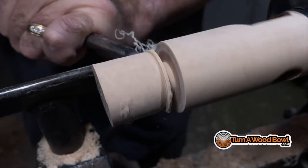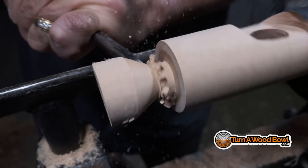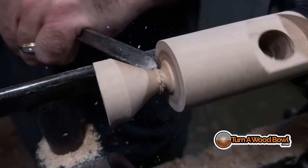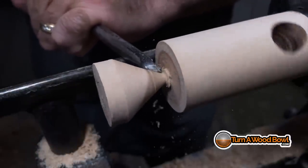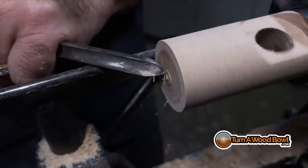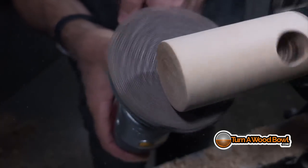I reversed the handle — I put a little bit of gaffer's tape around the other end and mounted it into the chuck. The gaffer's tape is so the chuck jaws don't create marks on the wood. Now I'm going to remove the waste material from the opposite side of the handle using the spindle detail gouge to remove that excess material. I really want to cut those end grain fibers — if I go through with the parting tool it's going to rip them out and leave torn grain. With the spindle detail gouge I'm cutting those end grain fibers instead of tearing them out. Clean up that point, ease the corner to soften that sharp 90-degree edge.